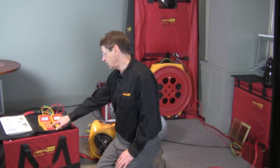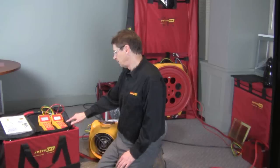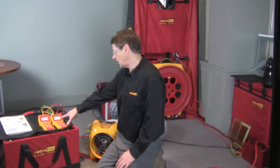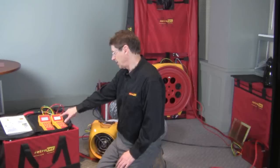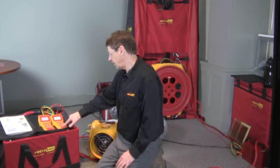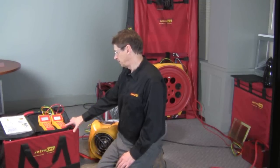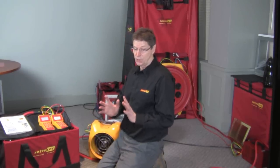You'll notice as soon as we turn this fan off that this duct leakage rockets right up. It's going really slow, so it's not all that accurate, but if we go set pressure 25, notice that it goes right back up to 160 CFM. So that is duct leakage to outdoors under depressurization.